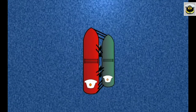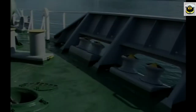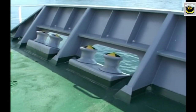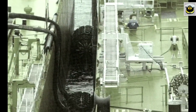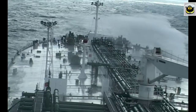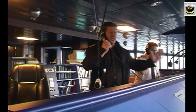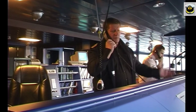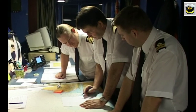Once in position, mooring lines are passed as per a predetermined mooring plan, and lines should only be led through class-approved closed leads. The operation is of a high pollution risk and should be aborted in case of too much wind or swell, or if the masters of either ship have the slightest doubt about the safety of the maneuver.